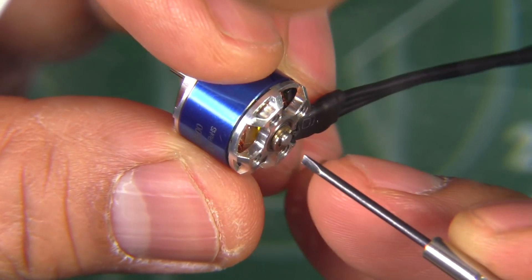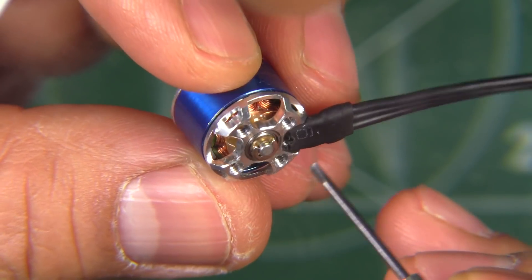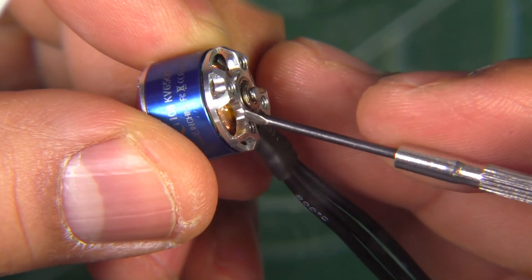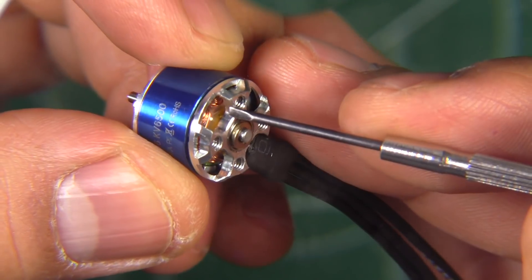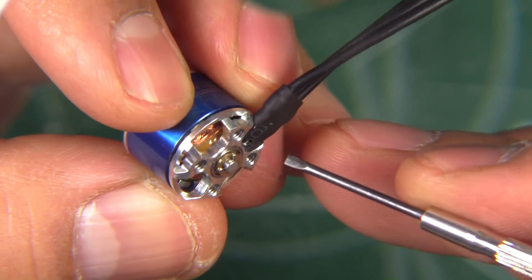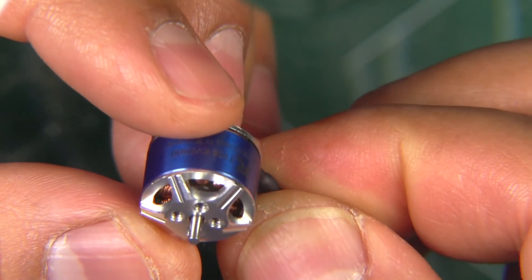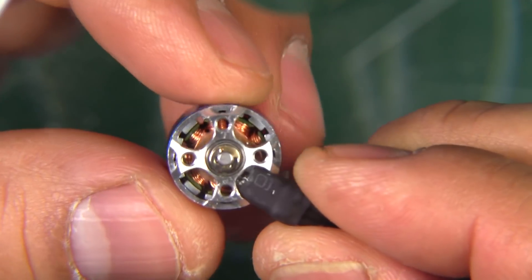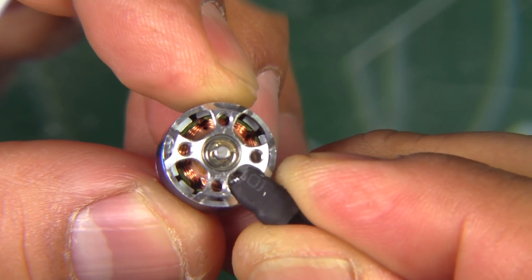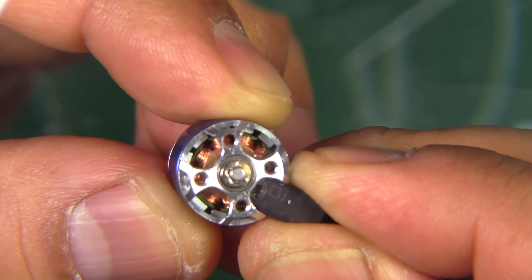Under the magnifying glass, there's some good attention to detail. Sony Sky went ahead and did a little bit of reinforcement for the motor wires at the bottom — the motor leads. From the stator, you can see there's some epoxy being used at the base, which keeps the lead wires in place. That's a pretty nice touch. You can also see the tolerances on the motor look pretty good — actually pretty tight air gaps — so this motor should make pretty good power based on the construction.